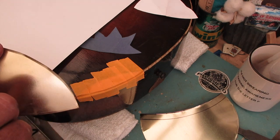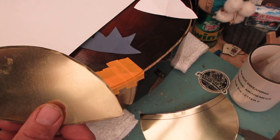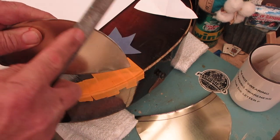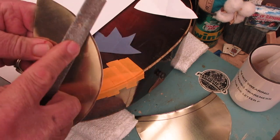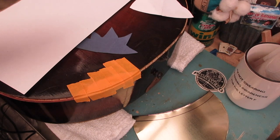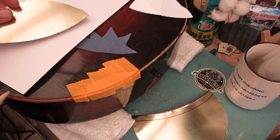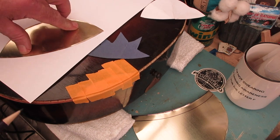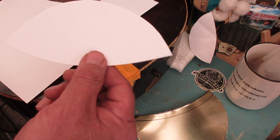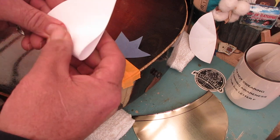I've cut this out and taken it to the belt sander. When you're working metal on a belt sander, if it's digging in, that's telling you it's not smooth. You always want to take a hand file — you don't want to cut anybody. Run this over like this; you don't want to make it sharp like a knife. Now I'm going to put screws in this to hold it down — I don't want to depend on adhesive. For that, remember the snowflake trick they taught you in school: you trace around and cut it. I've done that already to save time.